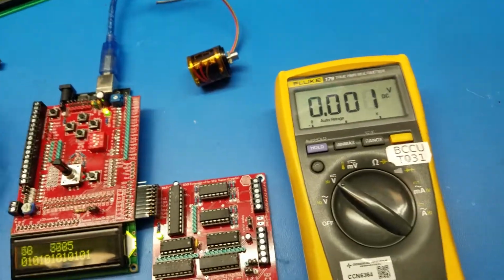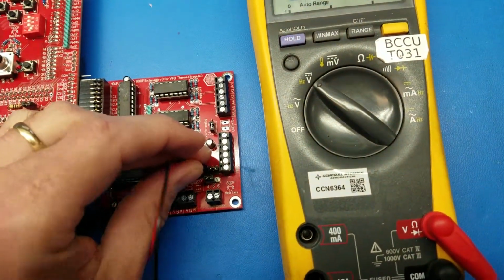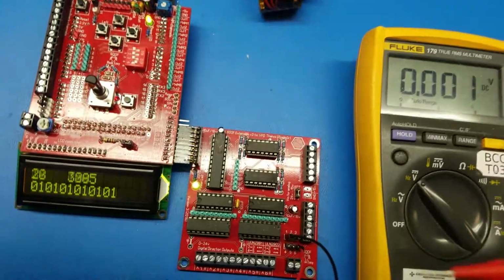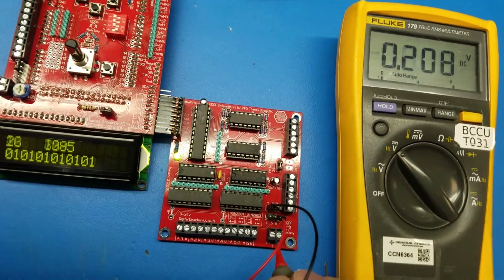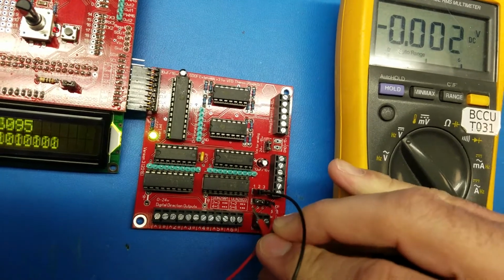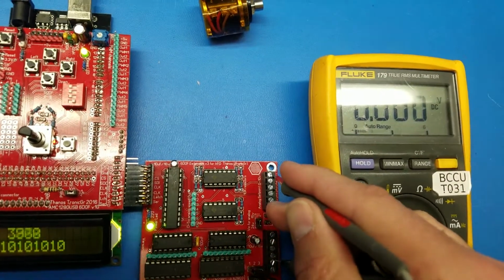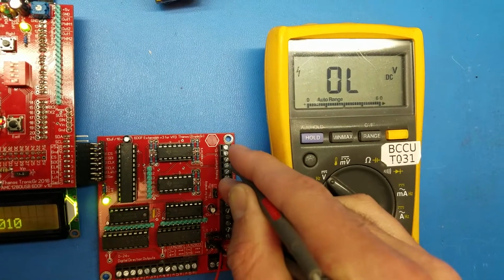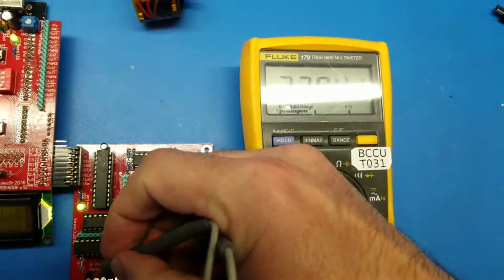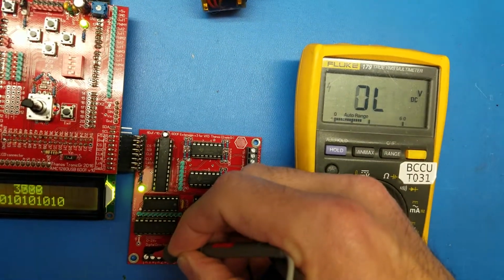Now if I apply 24 volts here, let me connect my 24 volts. I'm going to connect them with the heater here. Bypass the connector, but you should just connect to the connector to be safe. Of course I can measure now my 24 volts here, if I can reach it. What happened? Okay. And then you can see here, it goes up to 10 volts. It doesn't give a chance to check it. Let me see this here. You can see 2 to 3 volts and 0 volts.